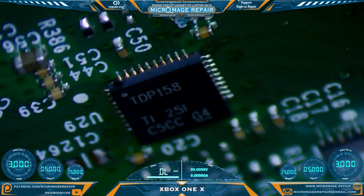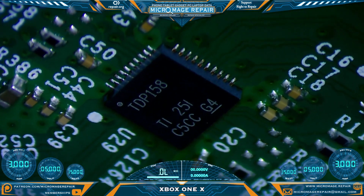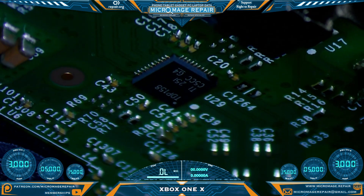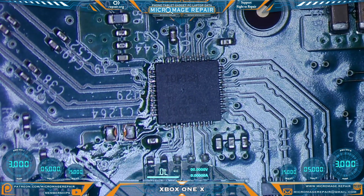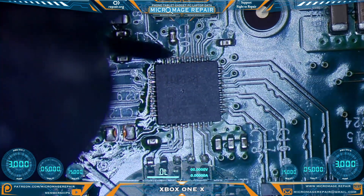Remove the heat, hold it down, and it should be good to go. Those copper marks on the side are what they call alignment marks — as long as you are lined up and flat, you are making contact. If you want to go over these pads you can; it isn't too densely populated and you're not likely to bridge something. Whereas on a Nintendo Switch I generally don't recommend touching up on those devices — you're highly likely to bridge a capacitor or a couple of capacitors together; there's just not much room to work.